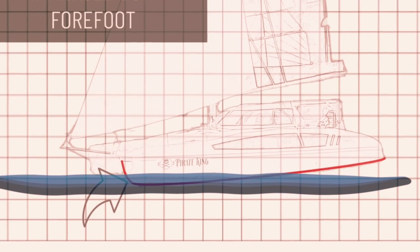So basically what you're trying to do is stop leeway and get the boat tracking in a straight line. The bow knuckle — as long as that is in the water — provides tracking. If the boat is hobby horsing up and down and that part is not immersed, you get more leeway. It's like trying to saw a piece of wood without the tip in the material — it goes all over the place. You need to define your track.